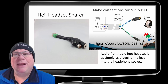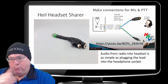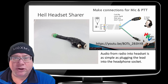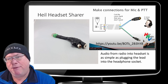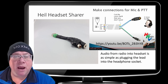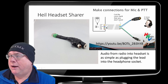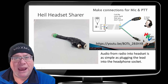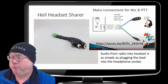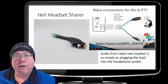There was one thing that I did have to make — I'll put a link up to a video that I made a couple of years ago that details how I made this. This is to control the PTT of the 991. The pinouts are as per the schematic here, and literally all I did was I took a Cat5 cable, cut it up, soldered a headphone socket onto it for the microphone, and also an RCA socket for the PTT.